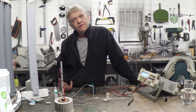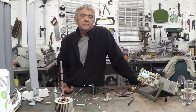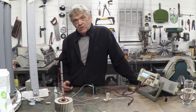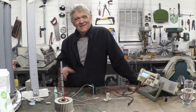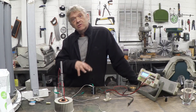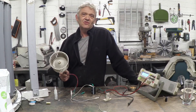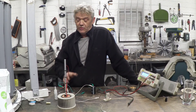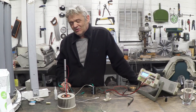If we want to know how much energy we've got: dead simple — 500 farads, whatever the voltage is read across the capacitor, you can calculate the joules, and that's what's come from the generator and is now doing real work across this motor. So I don't necessarily agree that putting a capacitor across a generator gives no information. I think it depends how you deal with it. Sure, putting a resistor across is a standard way, but I don't think you absolutely have to. I find this more satisfying because I want to know how much energy I've got stored away to do something with later. It's dead simple to do something on your tabletop — you can actually make yourself a usable generator creating usable energy with a few basic tools and a few bits and pieces.